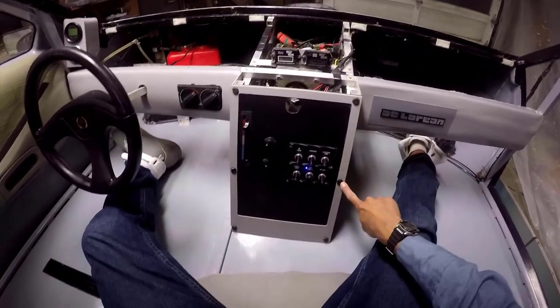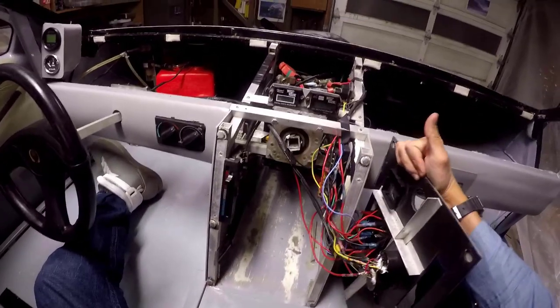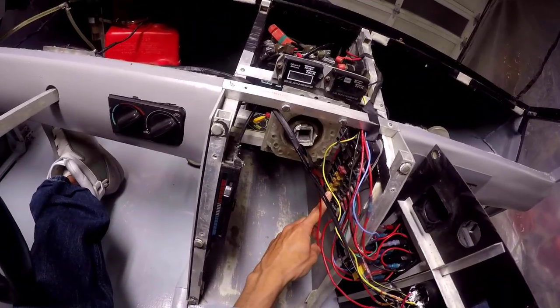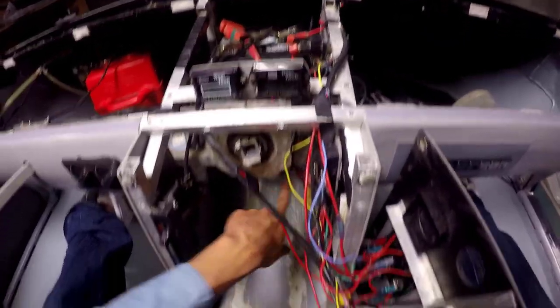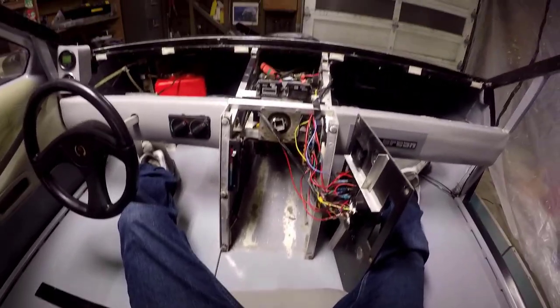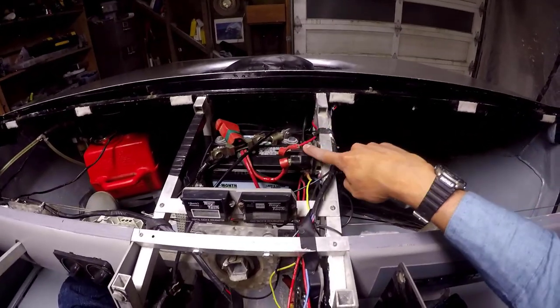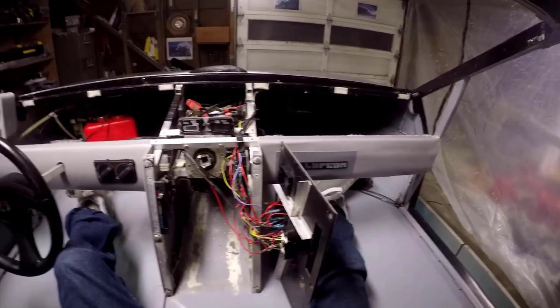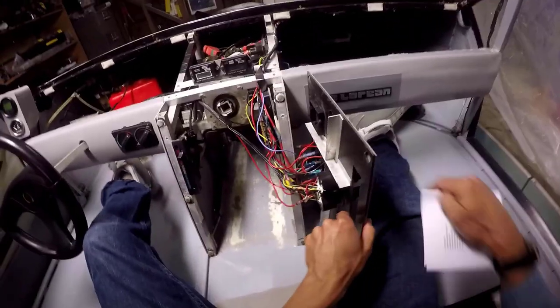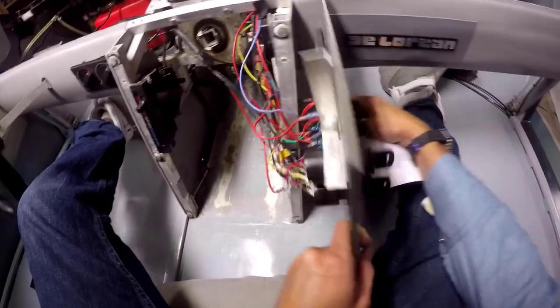The console is held on by magnets here. Back here you got your fuse system and the circuit breaker right here controls the fuse panel. There's another circuit breaker right here that controls the power to the thrust engine starter, so you can turn that off when you're working on it. Power goes to solenoid for the lift engine, regular lawnmower battery, wires going back here from the accessory circuit — power, fuel pump, fuel sender, GPS, speedometer, fuel gauge. And then some of the wires go back in this conduit along with the steering cable and choke control and throttle control cables.